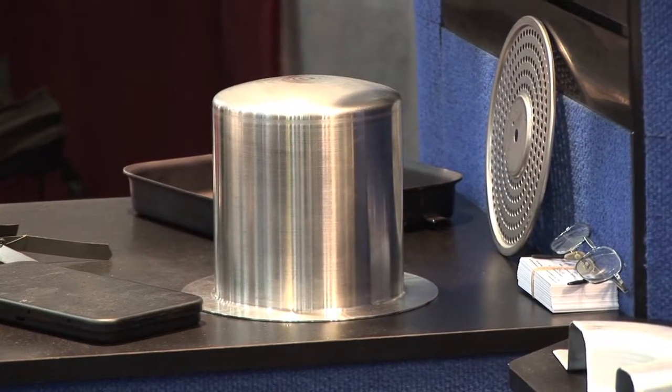The backing melts away leaving the ink to float on the water, and we simply take the enclosure and dip it in. The ink just transfers onto the plastic part, aluminum part, or whatever, and we clean it up, dry it, and then lacquer spray it. We end up with a custom novelty look, or whatever the customer wants.